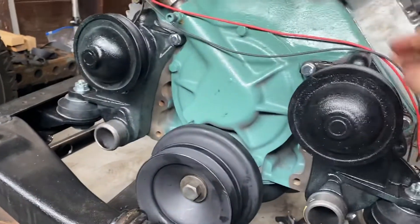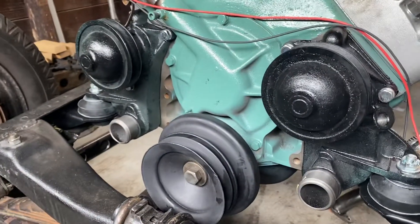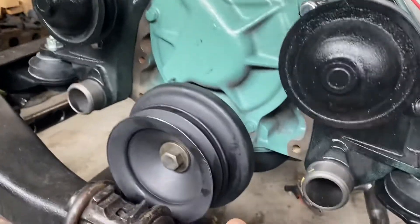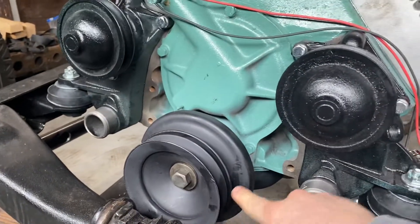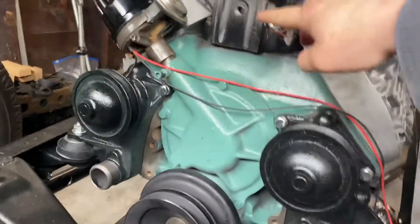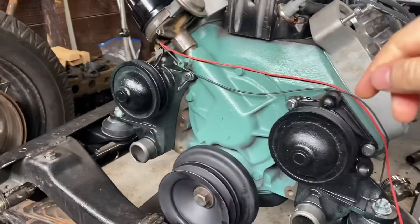So what do we have to do? They're connected somehow — how are they connected? Well, the way they would be connected would be a belt — not like what holds your pants up, but a long piece of rubber that actually connects them. It would run through here, around here. There actually should be another pulley up here. Back around, and this pulley on top is actually your adjustment — you can see there's a slide here so you actually lift up on the belt to adjust the tension and make the belt tight.